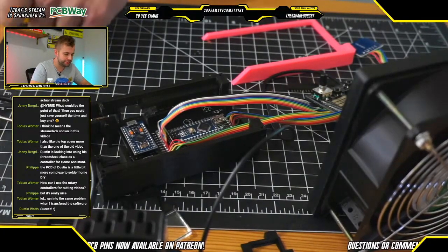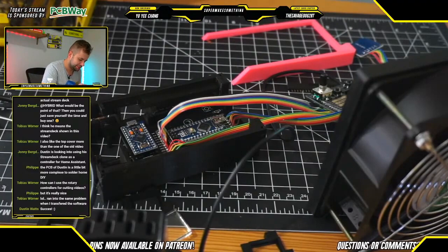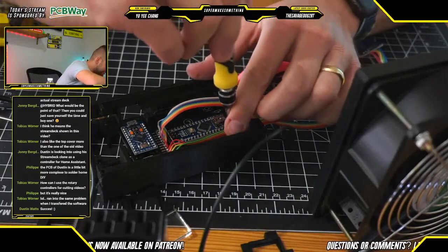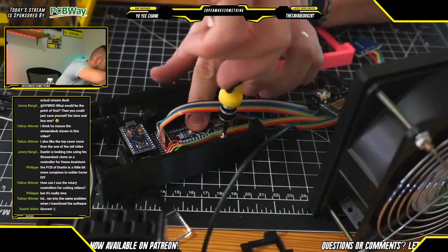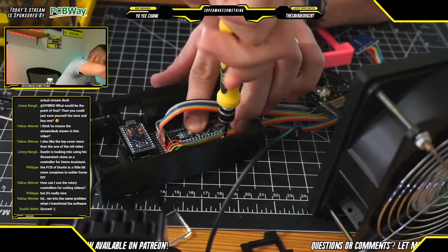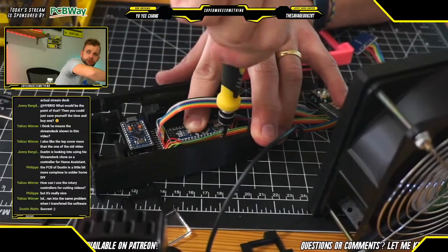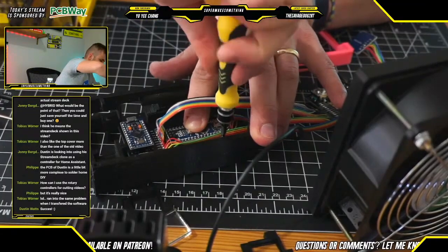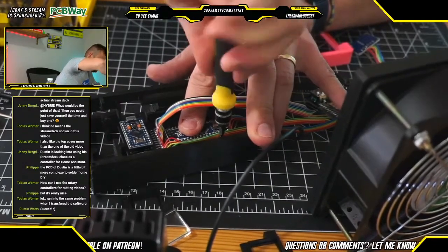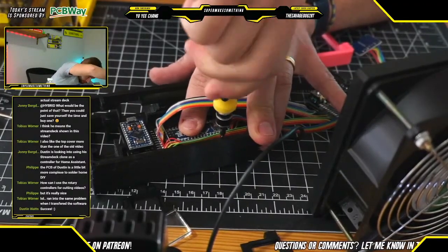For this design, to bring costs down, I try to use as many of the same screw as possible and nothing exotic. All of the screws in here, except for two of them used to attach the SD card reader, are M3 screws. I use two different screw lengths, but all of these screws should be possible to use with 10 millimeter long M3 screws. So in case you're building the Stream Deck for yourself, you don't have to go and buy six different types of screws, and hopefully things will be a little bit easier to assemble and to work with.